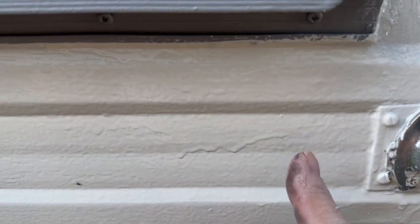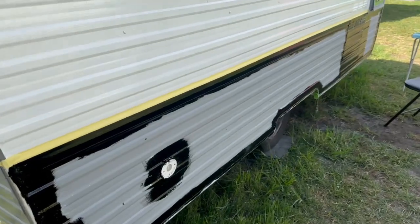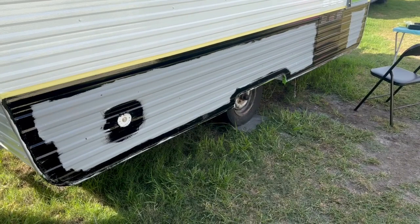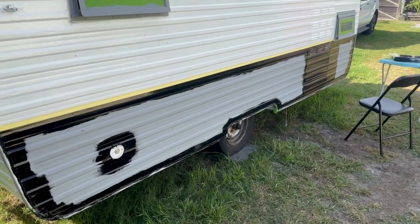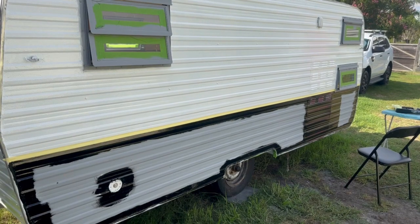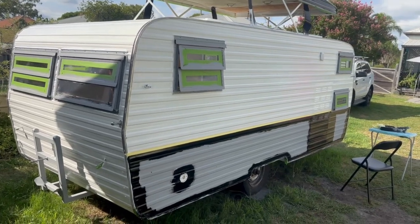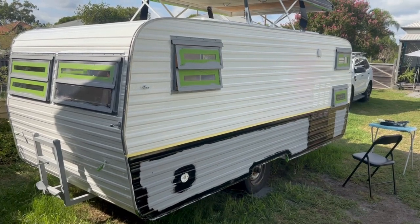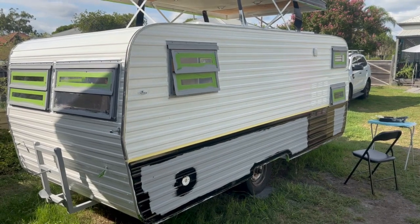Watch your rollers, don't trust the first bit of advice you get. Do an experiment - try a little patch. There's a little run from going too fast - that's what happens. I'll sand that back and paint over it. So: slow down, check your rollers, find your Goldilocks, do an experiment, wait a couple of hours to make sure it's not bubbling, then proceed. I spent nearly two weeks prepping, a whole day masking off, then painted the first coat of white and had to spend the next morning sanding it all back. Learn from my mistakes. Thanks for watching.